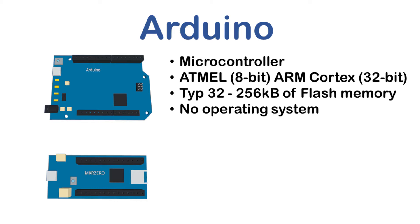Although the 32 kilobyte models can struggle with some complex programs, the big upside — and this is perhaps one of the strongest features about the Arduino — is that without multitasking, a program scheduler, or memory management, the Arduino can run in real time, or at least very close to it, without risk of the program being suspended by the operating system. This makes them very useful for functions that need specific timing, including controlling certain external devices.